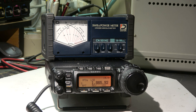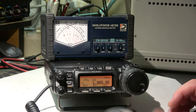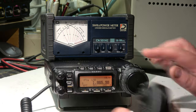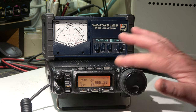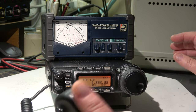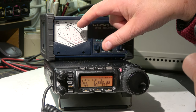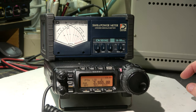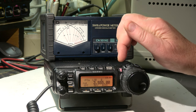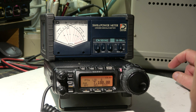The first thing I observed is that the PTT does not work. There is no lock switch - it's only for tone. There's also no lock on the transceiver. It is unlocked, but keys are also blocked; it can be set in one of the menus. When I use the VOX function, you can see there is output on 14 MHz but on 80 meters - nothing. The lamp shows transmission but no power.